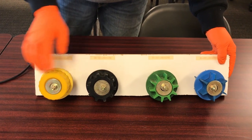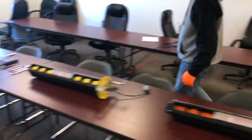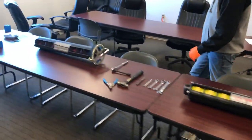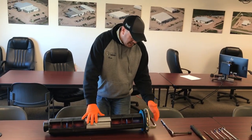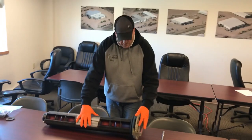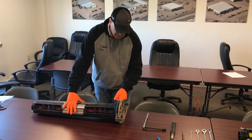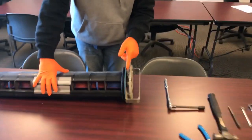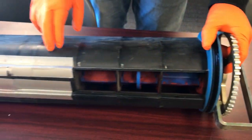Here is an individual section and this is what we'll look at when we tear apart a meter. Meter rollers should be torn apart and gone through seasonally, yearly, or just to make sure that everything is working correctly on them. This is a ground drive meter roller. We've got our sprocket, our handle with the flange nuts, and then a bolt through the hex shaft that we'll take apart and then we'll start taking each individual section apart.